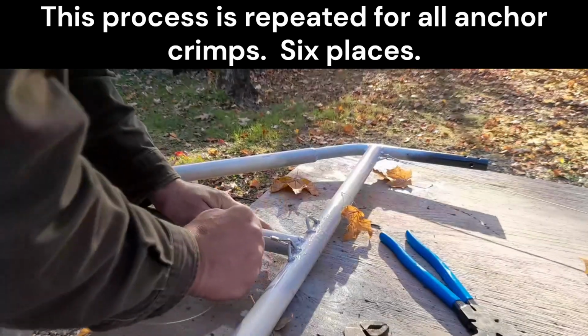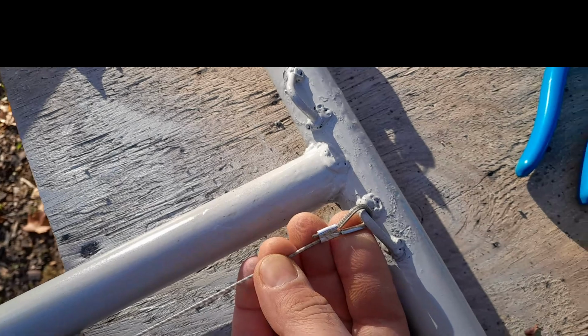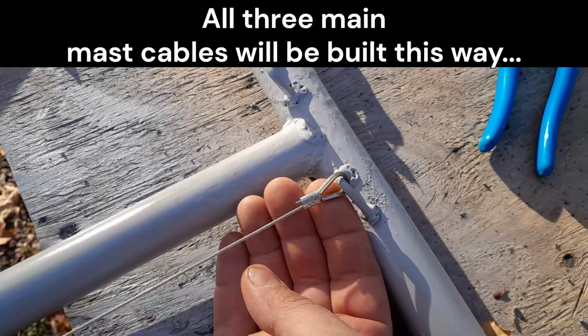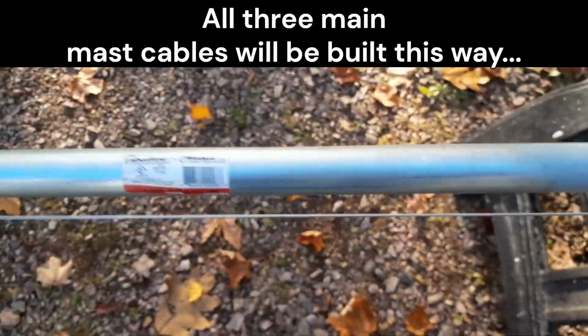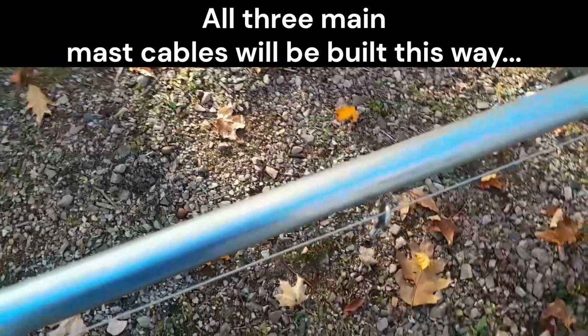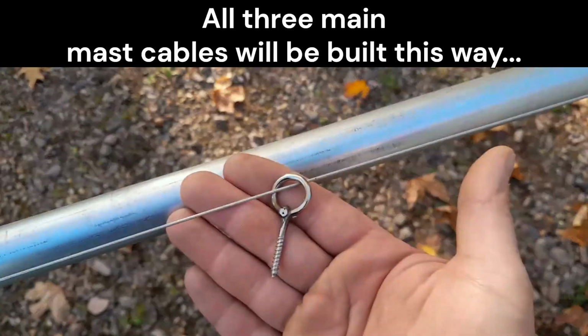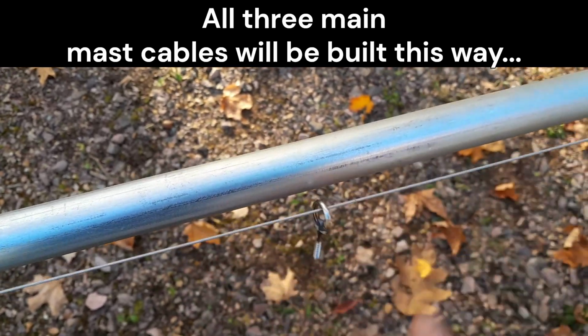Okay, it's pretty good. Here's the first cable in place. So you can see the termination, the thimble and a crimp. Some people put 2 crimps. I have in the past. Hopefully this will stay. And then running down here, don't forget, these are those eyelets that we welded closed. Thread one of those on before you terminate this cable.